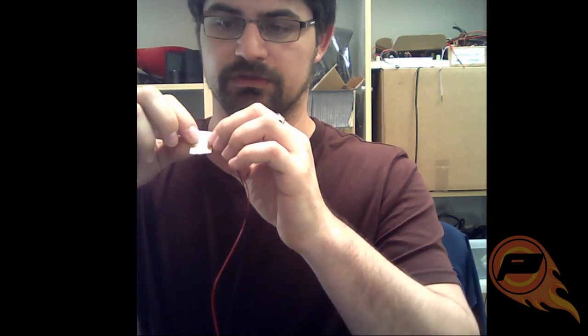Is the sensor negatively affected by a magnetic bed? I don't see that happening. The amount of electric charge that's generated by the piezos is pretty much good enough to overcome any kind of magnetic interference, unless you're putting something that's huge and electromagnetic on top of it. But even so, what the piezo senses is changes. So it doesn't have specifically a voltage at a particular spot. What it has is a voltage on change.